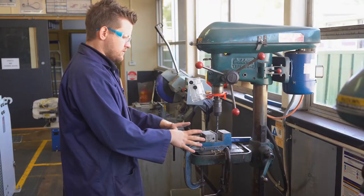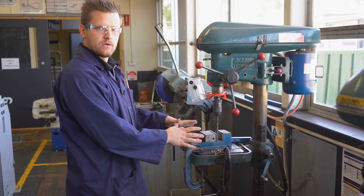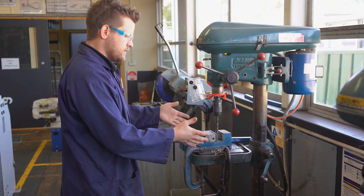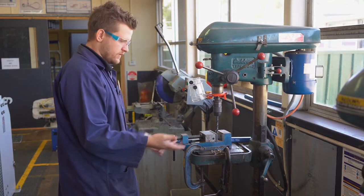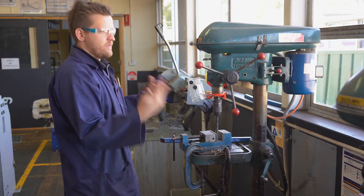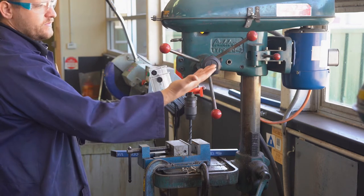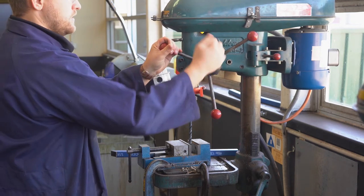This time our safety switch is on the floor. That way, with our hands up here, we can just put our foot on the safety until everything has stopped, then take our hands off, fix the issue, and get back to working.